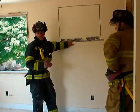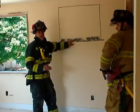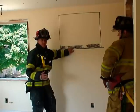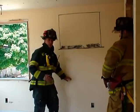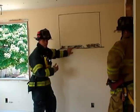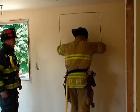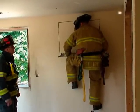Keep in mind that we're not always going to have a low windowsill height to affect an easy exit. In some cases, you might have windowsills that exceed 4 feet high. The threshold for a safe and efficient bail is about 36 to 42 inches max. If it gets higher than that, you're going to need to step up on something. If you don't have furniture immediately available, you can climb the wall — whether it's lath and plaster or drywall — just for the boost. Locate where the studs are by using switch plates or outlets as indicators, then keep that 16-inch on-center mark. That will help you make your breach with your boot and climb the wall to sill height, then go ahead and execute your bail or exit.